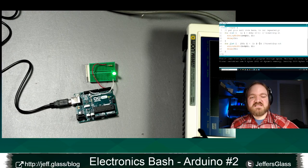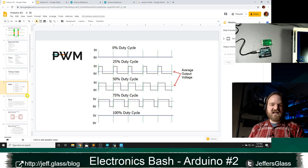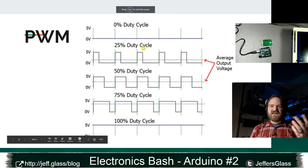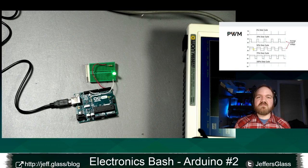But for the time being, you can think of the oscilloscope as essentially graphing voltages for you. I want to bring up a graph that we looked at last time. In fact, you can just look at this graph, right? When I presented this graph to you and said, here's how the levels in this pin are going, you probably pretty instinctively understood this is a graph of voltage over time, right? With time running along the x-axis here and voltage running along the y-axis, right? And really, that's all an oscilloscope does, is it's graphing voltage over time for you.